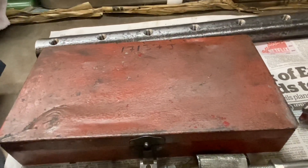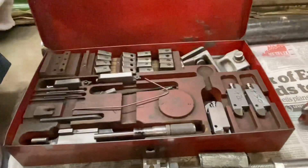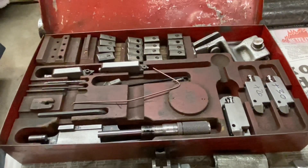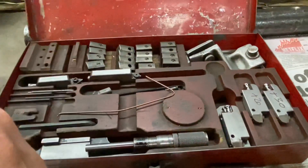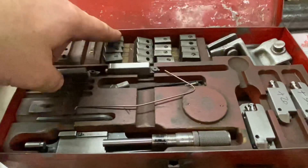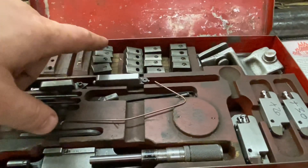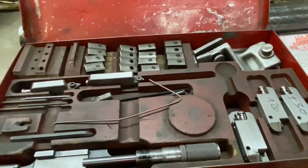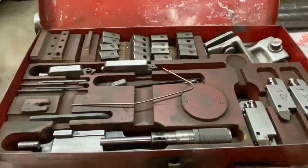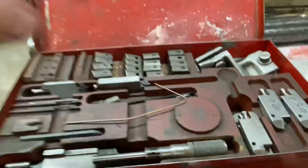The most important thing when you buy one of these 944 boring bars is the tool kit. Having the tool kit is vitally important because without it you can't use the machine. Some of the critical parts inside that kit are the setting mic for setting up the cutting bits to get the right diameter, and the cat's paws which are used to centralise the cutting machine in the cylinder bore and also for guiding the boring bar through the cylinder to give it support. There are a few other tools in there — Allen keys etc. for tightening up cutters and various other bits and pieces.